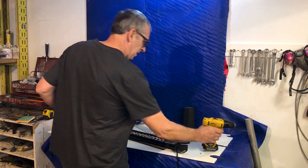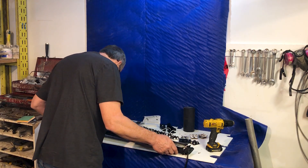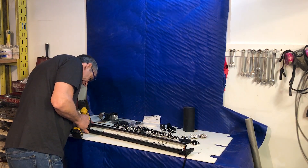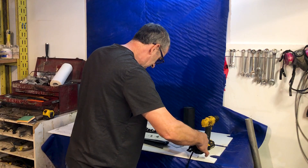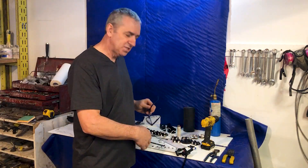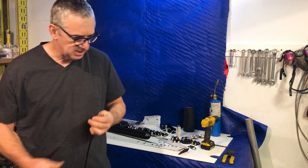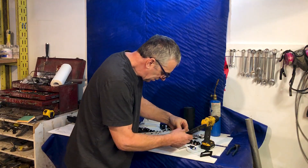I don't use the diffusers so they just end up in the garden — I find they don't help. Now we take two allen screws out of the ends and it should slide out. There it is — that's the part we want. Now that we have this slid out, we're going to cut the wires off right at the end cap, leaving as much wire as possible. We're actually going to reuse this wire. The end cap goes in the garbage, the board gets set aside. Then we're just going to strip the ends of these wires.